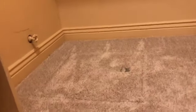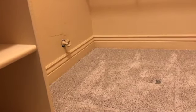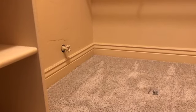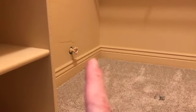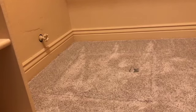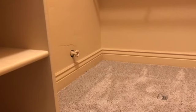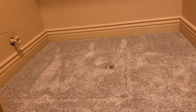If I go in this zipper door, we're in the closet, as you can see. It doesn't look like anything's going on here, but I pulled this carpet up a while ago when I was here doing the inspection and saw some mold growth, which we tested — it was aspergillus penicillium. So why is there mold growth in this closet? There's a water valve here, and this is the access for the crawl space, so probably some kind of moisture condensation or a water leak. The remediation company is going to pull the carpet up, fix all this, and cut into this wall to see where that moisture might be coming from.